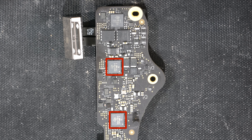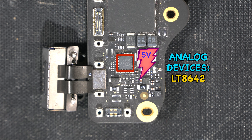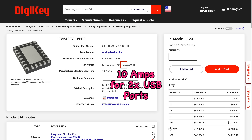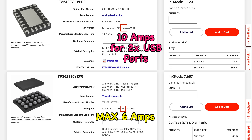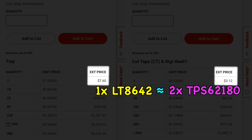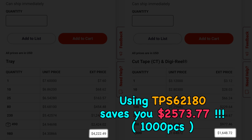Looking at the left side of the USB-C circuit, both CD3217s take 5V power from another IC manufactured by Analog Devices called the LT8642. This IC has never blown in our repair history. Comparing the datasheets, the LT8642 can deliver up to 10 amps of current, while the TPS62180 can only supply a maximum of 6 amps. This difference in current rating affects pricing — the LT8642 is approximately twice as expensive as the TPS62180.